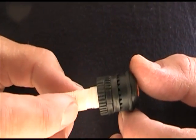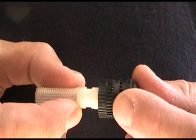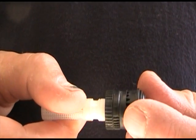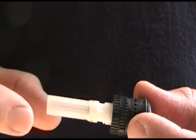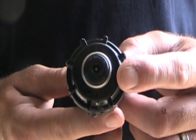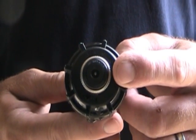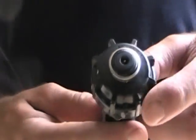On this too, it's going to show you these tick marks along the side. This is telling me that this sprays a half circle. It comes with its own screen, and it uses very little water, so you can run quite a few heads on one zone. They also have a wider range and more adjustments — you can actually get these to spray 30 foot.